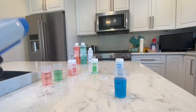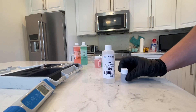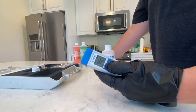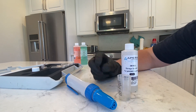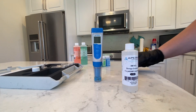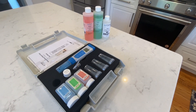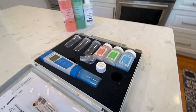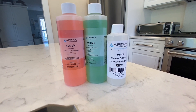The pH pen was reading pretty accurate, but it's still good to recalibrate every once in a while just to be safe. The last thing you want in the middle of a grow is pH issues — it's an absolute nightmare to deal with. The final step: whether you're done using the pen or not using it right away, always fill the cap that comes with the pH pen with storage solution. You really don't want that probe to dry out completely — check the fill line and make sure there's some solution in there. Put the cap on the pen. Don't be worried if you see crystals forming where the cap is — that's just what happens with the solution. Now that you've calibrated your Apera pH 60 pen, it should be accurate for at least the next 30 days. If you found this helpful, please like and consider subscribing — thank you for watching.